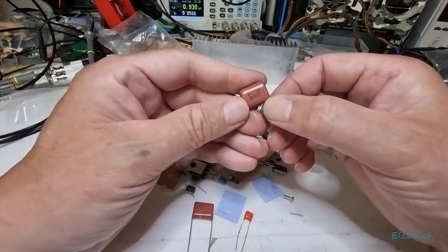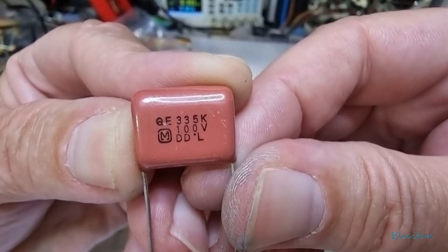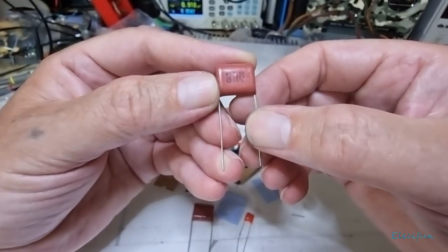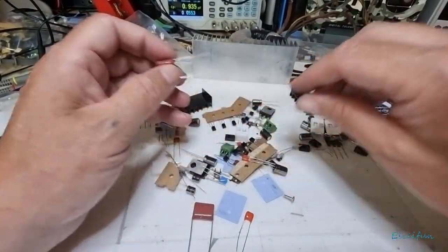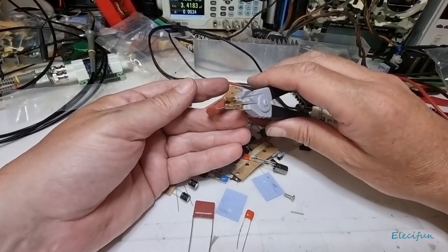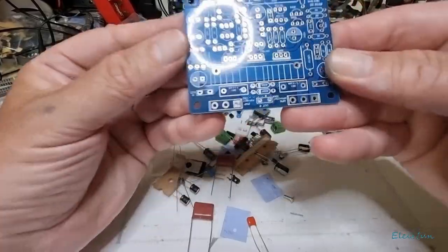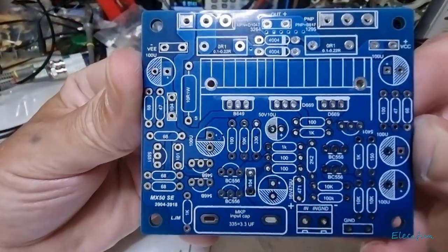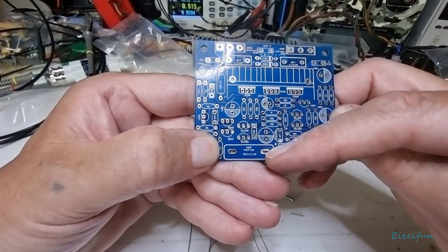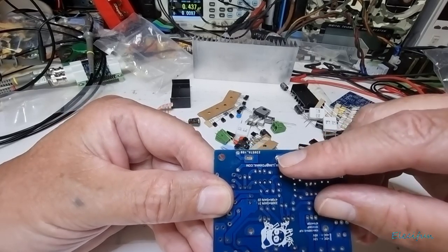What's that — 335, so that's 33 nanofarads? I've got micros and nanos but sure. Let me stick this on the meter so it can tell me what that is. So that's 3.4 — that's probably the input. The output there is 3.3 microfarads. Okay, so that's the input capacitor probably — from the positive to one side of that.